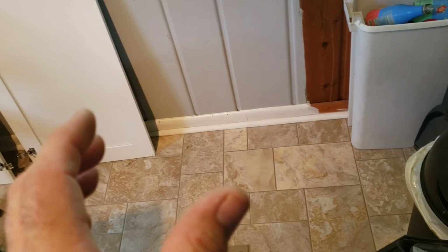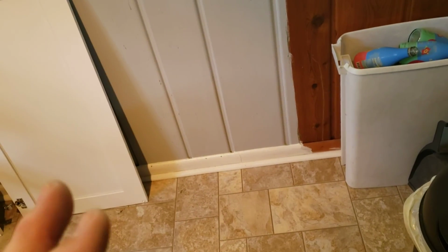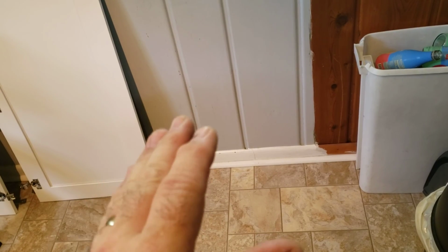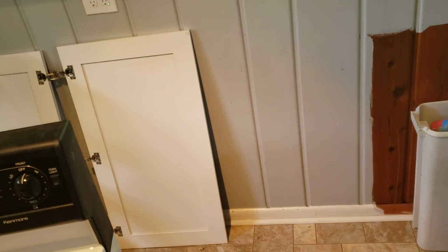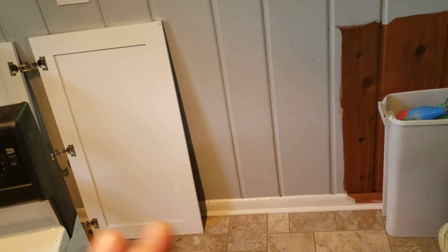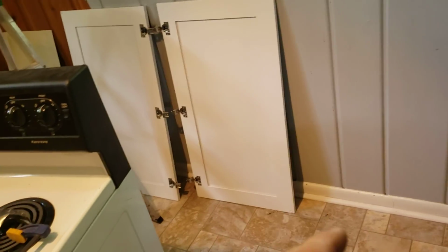Customer is wanting to come in and purchase a base wastebasket 18 with 2 drawers in it for recycling. You can see they got recycling bins here now. And what we're going to do is go ahead and put the cabinets in that go along this wall. And we're actually going to put two 18-inch spacers to be able to keep that space open. The caveat to that is we cannot put the granite top on until the actual base cabinet is installed. So make sure that that countertop does not get installed until after that base 18 gets back in place.